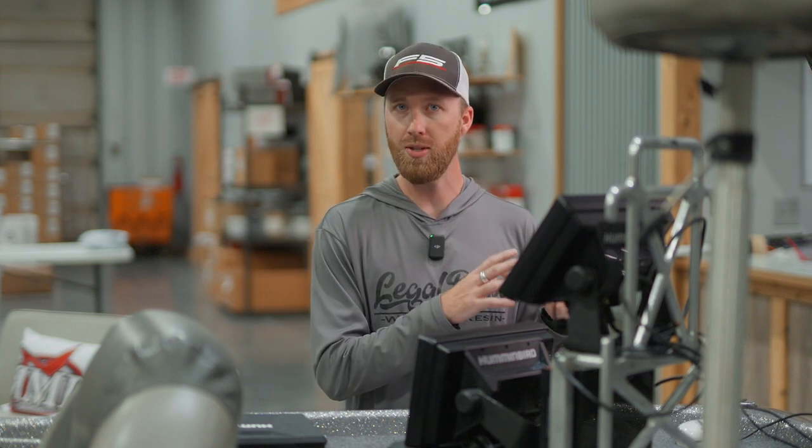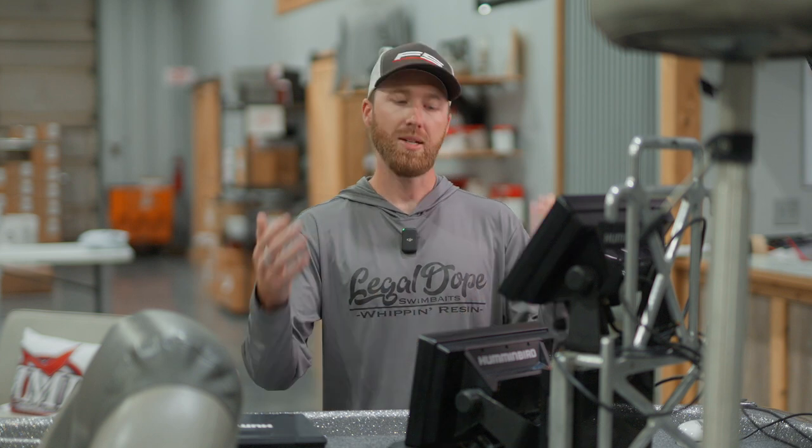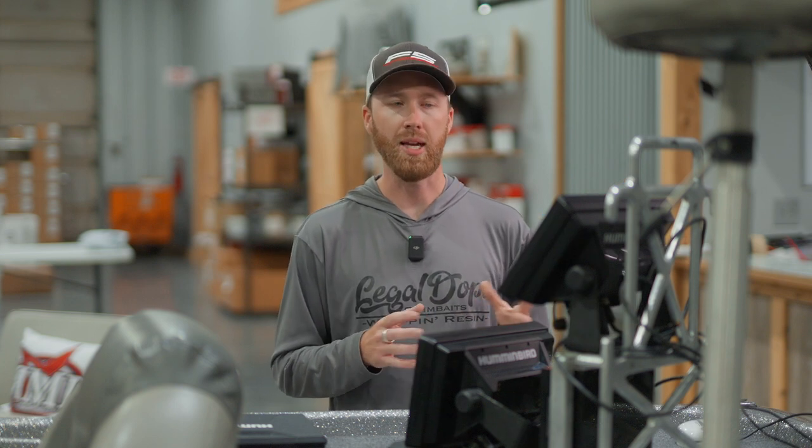These settings can be reversed depending on where your puck is located. What's important to understand is you want to mark waypoints as close to the transducer as you can. On the bow, if your unit is fairly close to that trolling motor transducer, that's going to be your best bet — especially if the puck is at the back of the boat. When we move back to the console, we want to mark waypoints from as close to that transducer as we can get. That's why we're mounting those pucks back at the splash well area or on the back deck, depending on how your boat is set up.